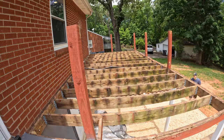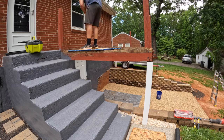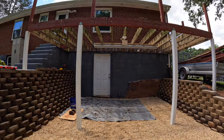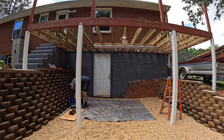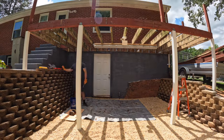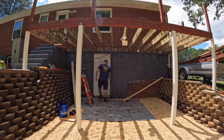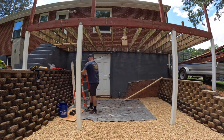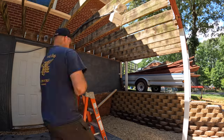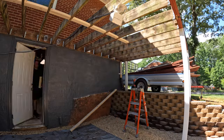The next step is to clean everything up — all the wood scrap, screws, dirt, and debris on the deck, make it nice and smooth. One thing I didn't do, which if I could do it again I would, is put down that rubberized tape you put on deck joists — it protects them from water and moisture damage. I didn't do it but I definitely would and I'll throw a link in the description. I'm also putting some screws into a couple of boards to make them sturdy and firm. I already have joist hangers on the deck, so I didn't need to add those.